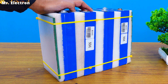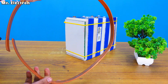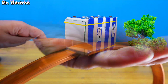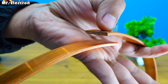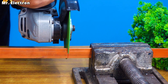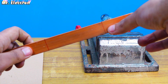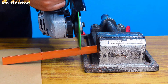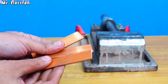For connecting these batteries in series I'm going to use this copper piece. I'm going to cut out pieces for bus bars with a cross-section of 20 x 4 x 75 mm. These are capable of handling up to 300 amperes, which is very good — pretty thick. Here I'm going to cut it into three equal pieces with the places already marked. Time to do some drilling for the bus bar holes.